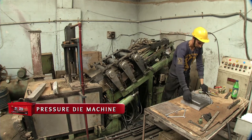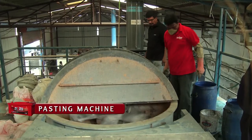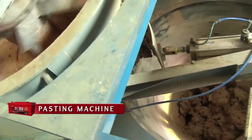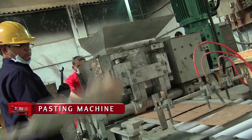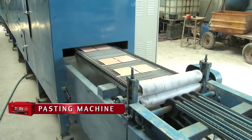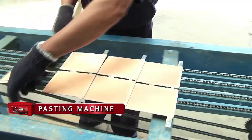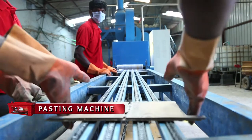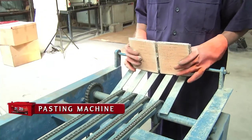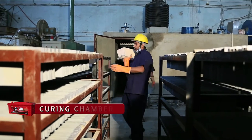Though these machines are available in standard specification, the pasting machine can be used for double-side pasting. The machines are a conglomeration of technology with two belts that drive the plates under the hopper, with motor-driven rollers between belts to paste on both sides. The machine comes with an in-built control panel, main electric board, pasting belts, and a pair of hopper shoes as per client requirement.